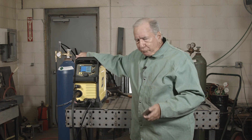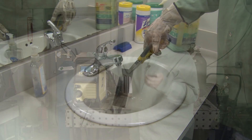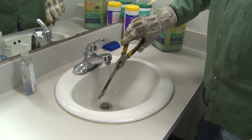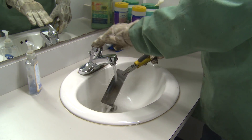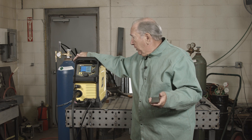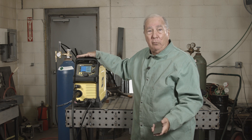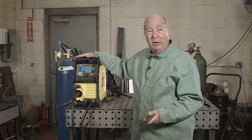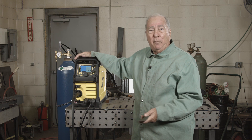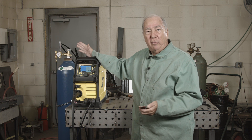Since I'm going to make all three welds on this one piece, to keep it even I'm going to quench each one when I'm done — just dip it in water so the plate stays at the same temperature for each weld. Because if I just did a repetitive weld on here, the thing would get so hot that you really wouldn't be able to make a fair comparison. So we're going to weld at the recommended setting, then go down 100 inches per minute and make a weld, then go above the recommended setting by 100 inches per minute and make a weld, and then do the comparison.